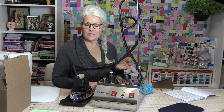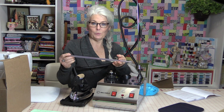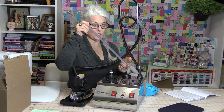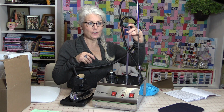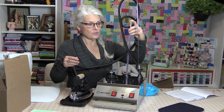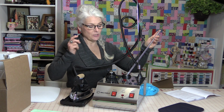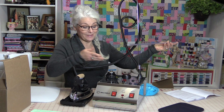If you need to check and see how much water is in it before you start the day, they do have something which we nickname as a dipstick. And it's a long tube. And this tube has measurements on the end. And what you would do is you're going to push the measurement side into the tank. And putting your finger over the top of this long hollow tube, when you pick the tube up, you will be able to see the measurement in the bottom, and you will know how much water is in there. And that's how we measure the water in the tank.